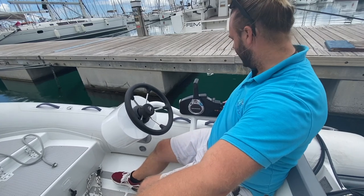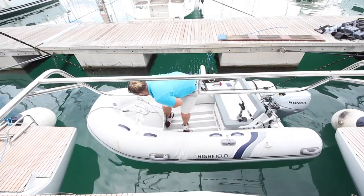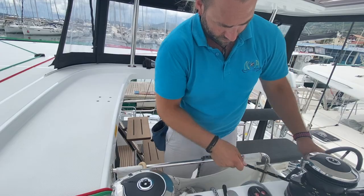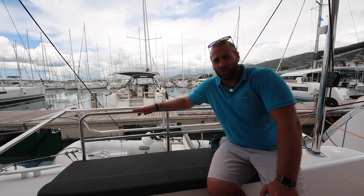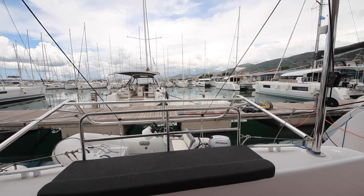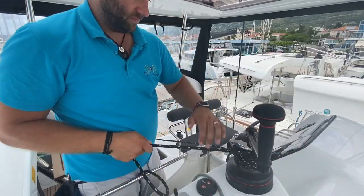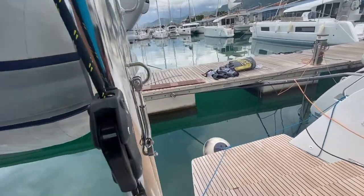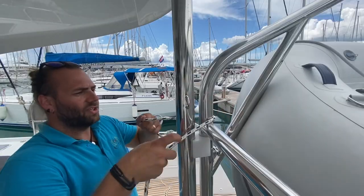Turn off the dinghy, turn the key. When raising back up, clip your bridle back on to the davits. When bringing the dinghy back up, take the davit line up to the electric winch, ensure the clutch is closed at the davits on the back, and then bring this up slowly on the electric winch. Ensure the clutch is closed and do up the safety clips, and tie on the extra lines.